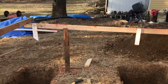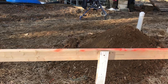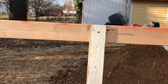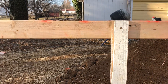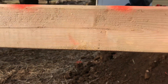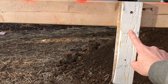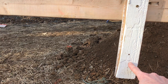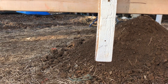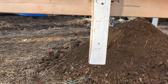That gives us a guide we can use to figure out how deep the holes need to be. We're going to have 2x10 joists — 2x10 floor framing for this porch. So what we did was put these scrap pieces on there and measured, putting a mark that is nine and a quarter inches below that 2x4. That'll be the bottom of the floor joist and the bottom of the rim joist that sits on the pier.